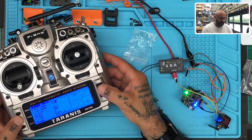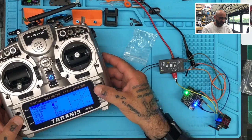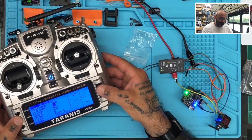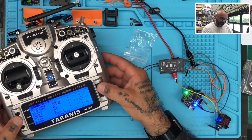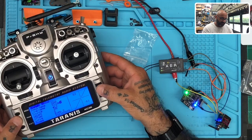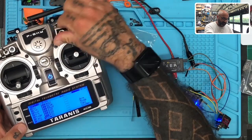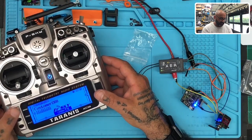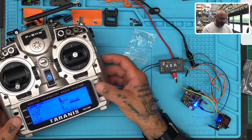We'll call it slider. I am a little hungry so I've got the shakes. This would be a good testing setup anyway — that's what this X9D is for, just testing purposes. Now that we're a FrSky repair and RMA center I know we'll have more questions coming in, so I'll reserve some of these. We'll call it slider, set the source to S2, and exit. You won't get any action yet. We go to menu, then mixer, click to add it, and call it slider as well.